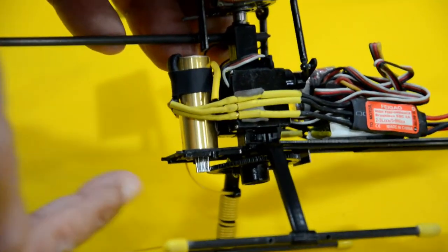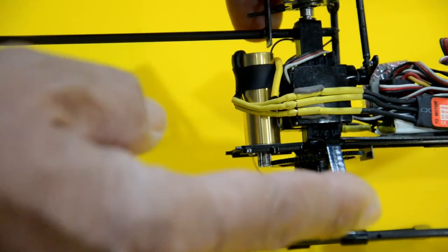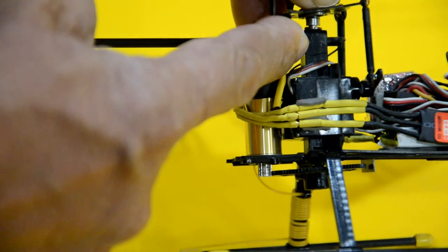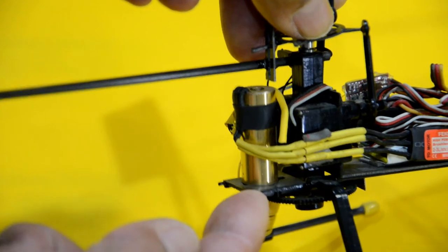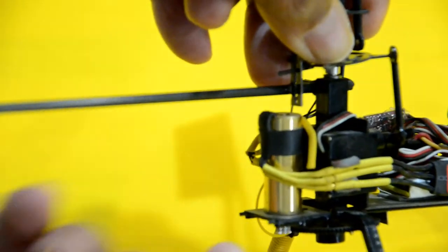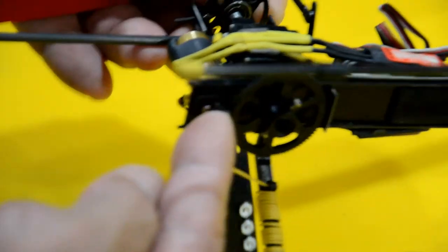This part in the back was also molded as part of the landing gear, on an aluminum mold that I also designed from scratch, to mold all these parts in one shot. Now this landing gear has a post that has been molded with 2 openings at the top and at the bottom to house 2 ball bearings for the main shaft. And this part that supports the motor is also molded as part of the landing gear. It was molded with 2 slots to allow the installation of the motor to be adjusted, so that you get a precise mating between the pinion gear and the main gear.